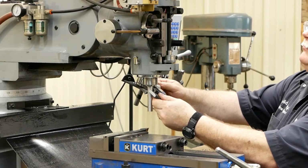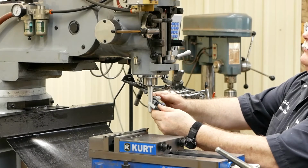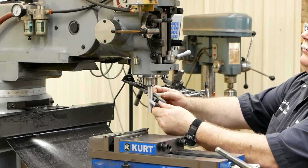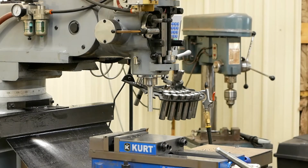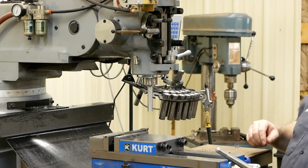602/10, 599/4, 601, or yeah, about 3/10 under. We got a little bit of taper in it, not much, but that'll be fine. So anyhow, we're real close to 600.